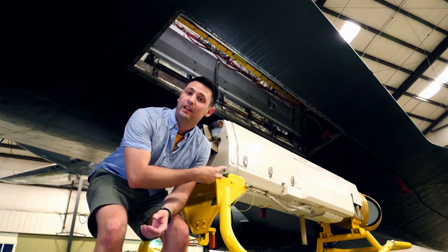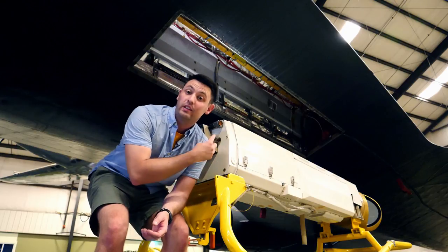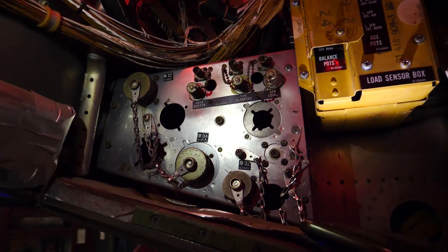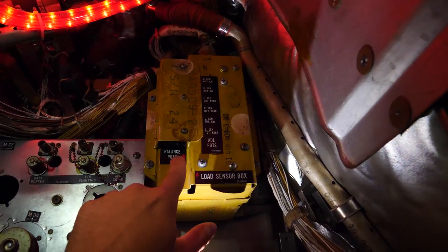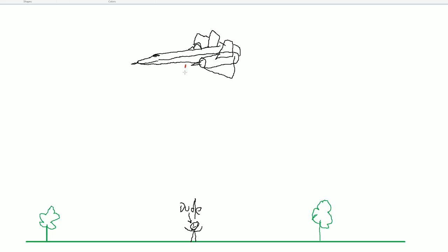The speed of the photography was actually calibrated by the speed of the aircraft with the air navigation computer. They had two of the technical objective cameras, one that sat on the right-hand side and one on the left-hand side, and they both went in one of these bays. The two tech cameras at each side of the bay were able to shoot at full nadir — pointing straight at the ground — or 45 degrees outboard, which allowed them to photograph whatever they flew near.